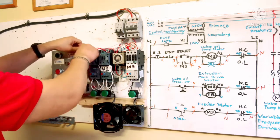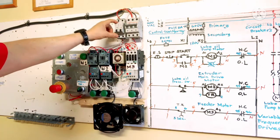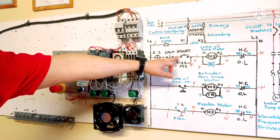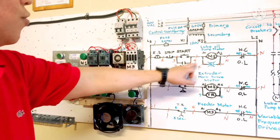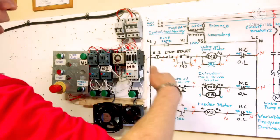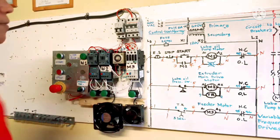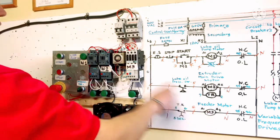We're going to try. First, turn on our supply for the motor and turn on our control circuit. Now, when we press the start button here, M1 is energized. This is our holding contact for M1. When M1 is energized, it waits for some seconds, then builds up the pressure to activate the pressure switch. Then M2 and the timer relay both energize at the same time, and after 5 seconds on delay, M3 is energized.